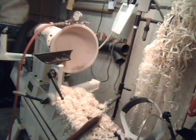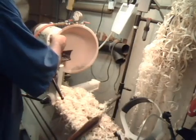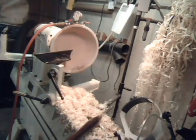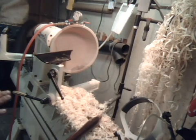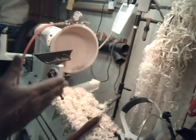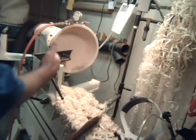You can, Ben. Really, any kind of sealer. You can even use denatured alcohol to wet that surface. You're just trying to make them fibers lay down or firm up enough just so you can cut them. I'd be leery of really using wax unless you plan on using a wax finish on your bowl. If you put wax in the wood and it gets ground into the pores that you didn't do a good job of sanding, you're going to have adhesion problems with the finish.